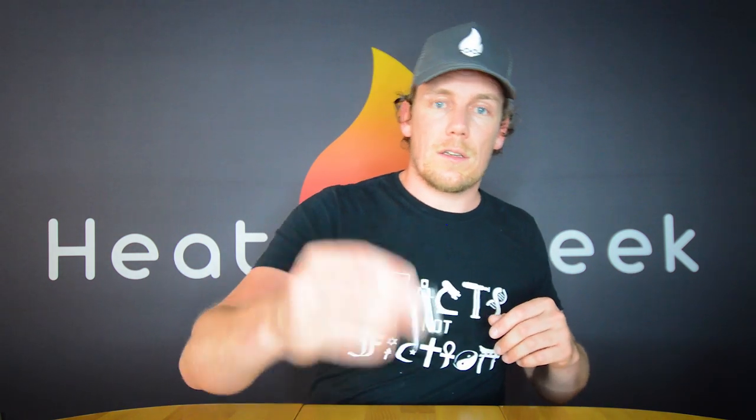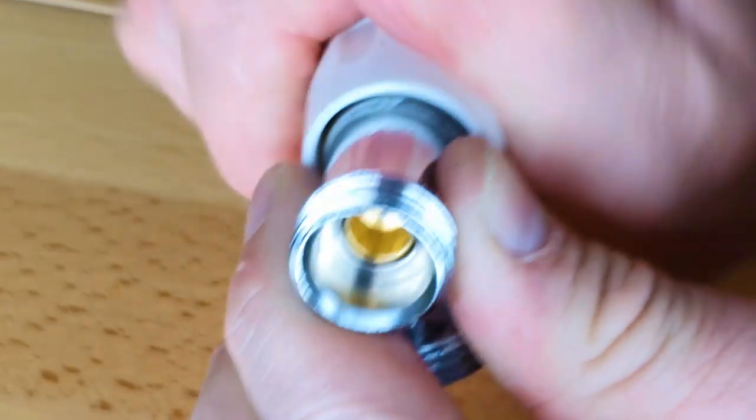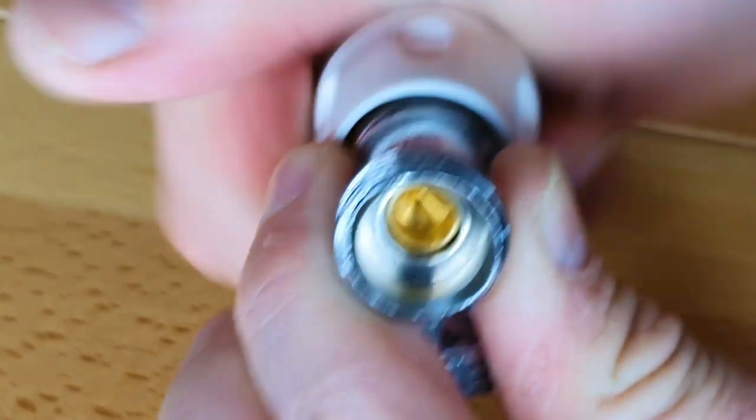Now while ordering these valves, we also came across this cheap solution - an old-fashioned union connection. This valve has a small inlet and small outlet. Comparing with the 15mm version, this valve already has increased authority. I think this might have even been the cheapest valve that we found. If I close the valve all the way and look how much further it travels - you've got about two to two and a half turns before it opens. That's much better. However, when fully open, it doesn't completely clear the flow path - it's kind of dangling in the way, interrupting the flow a little bit. So that was a nice surprise to see.